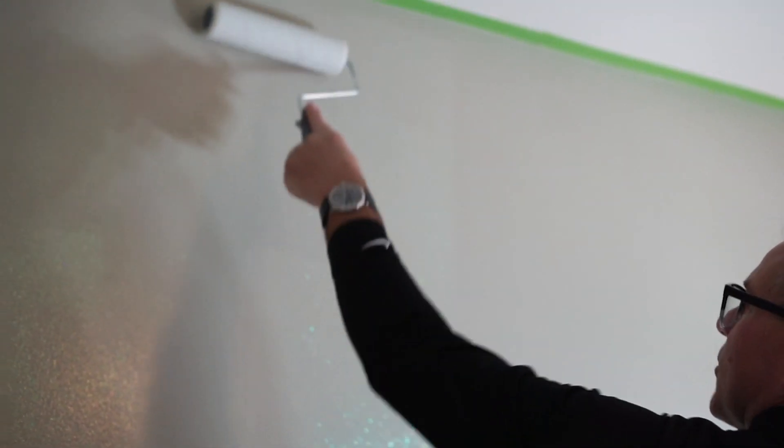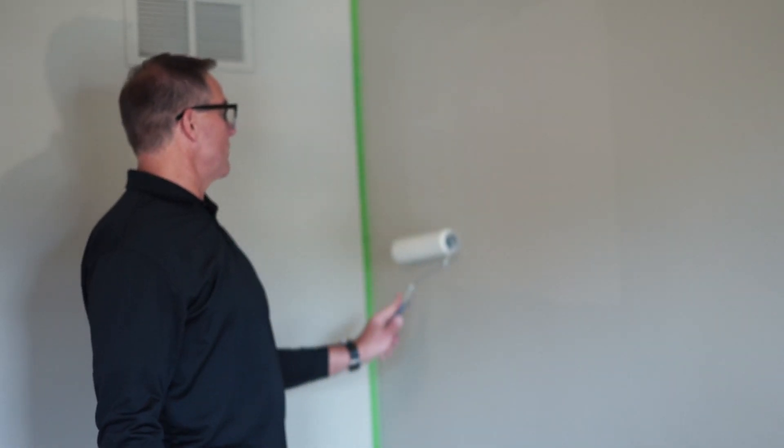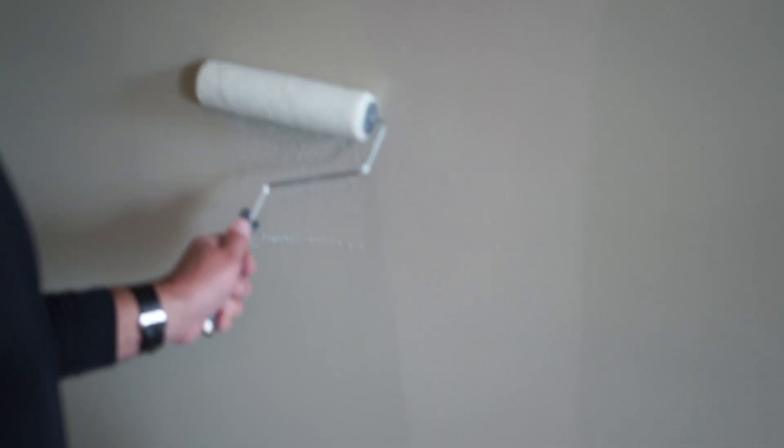Because it's iridescent, you really have to pay attention to make sure there's no roping. Roping is when you push the roller too much and apply too much pressure to it — you want to avoid that at all costs because that will change the look. It's also important that you have good lighting so you can see what you're doing, because with the iridescent finish it's just kind of covering and it's going to give you that hint of glitter right over the top. It's going to look great.